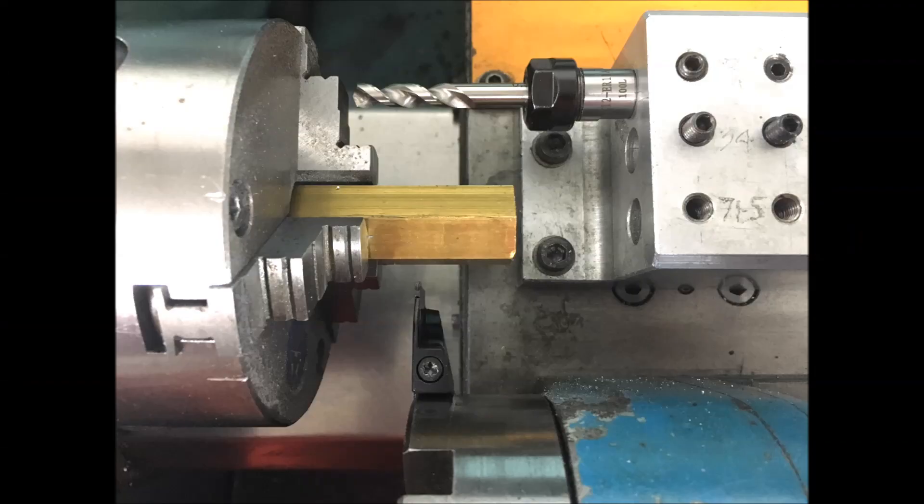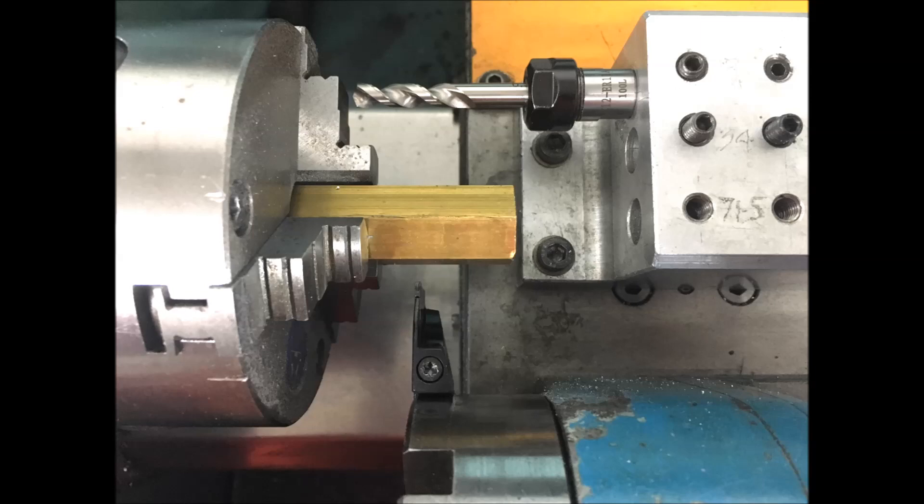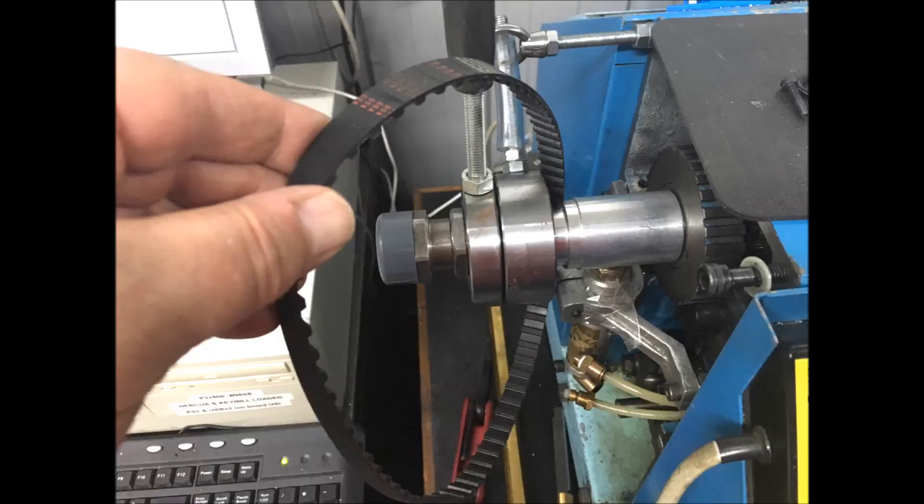As you can see, when I planned this first I didn't plan it very well. The drill is going to be into the chuck before the parting tool is anywhere near the chuck to part it off. So I changed ideas to a 5C collet hole. That'll work, and then I realized I've got no room for the parts catching tray so the aluminium block has to go. And while all this is happening I realized I've got to change the pulley on the motor down below, and I can't get the belt out because I've got to remove some parts of the collet closer to make that happen.